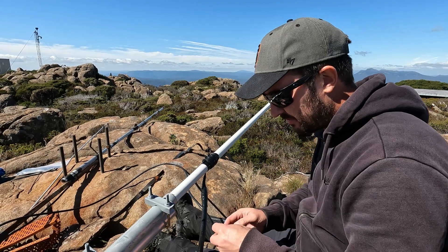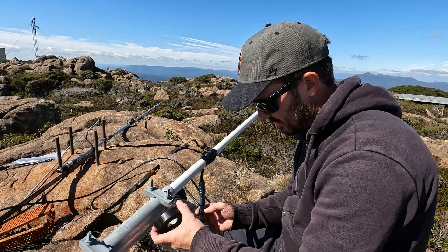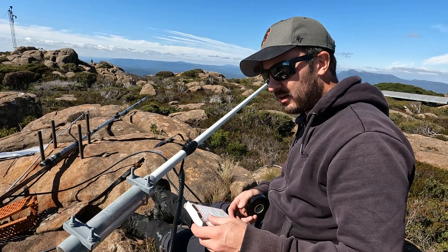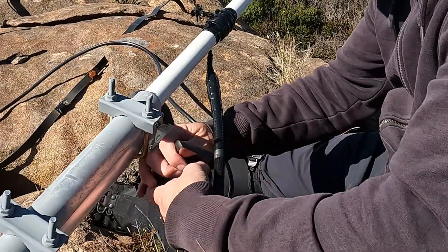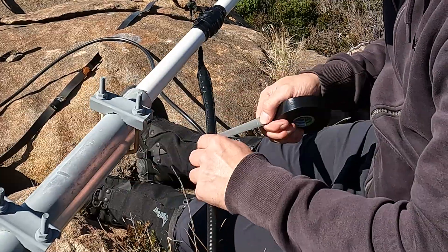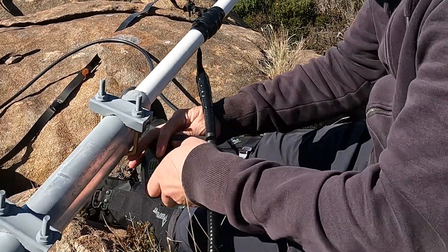So now the amalgamating tape here — you don't put this on like electrical tape. You put this on but you have to elongate it a little bit — elongate 80%, almost twice its original length. So that'll then provide the seal. I usually just stretch it out like that till it goes that sort of light greyish colour, and then you keep going over at half laps.